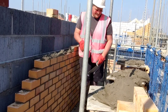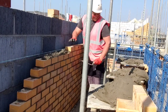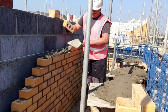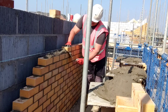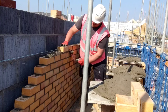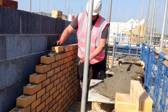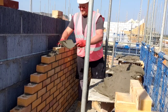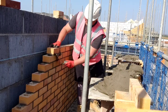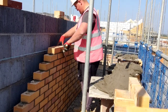The concrete bricks are a little bit more forgiving for learners, but obviously require more pointing. So when we're on the concrete, hopefully everyone will be able to get some more laying done, and then we can all team the jointing up at the end when it's gone off a bit. And we'll be doing a few different methods. At the moment, we're just using five board setups. When we go on to using the concrete, it's going to be closer to a 9-10 board setup, running in long flanks. I'm going to be tailing out small corners freehand with the level.